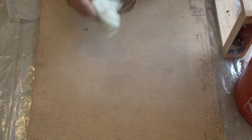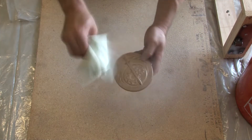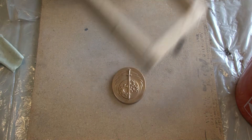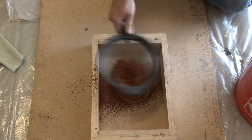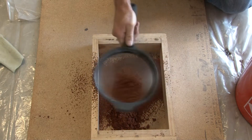One of the suggestions given to me by a YouTuber who also makes castings was to paint the board. I haven't gotten around to it yet, but it makes obvious sense that if you paint the board, it'll keep the oils from soaking out of your Petrobond into it and keep your Petrobond more stable around where it touches the board. I still want to do that and will probably get it done a little later on.